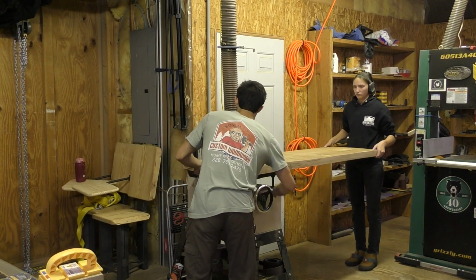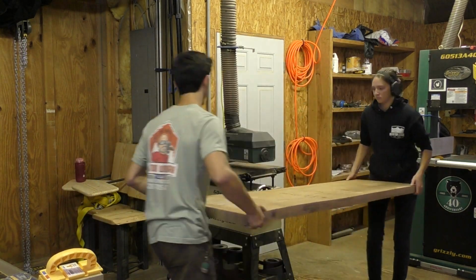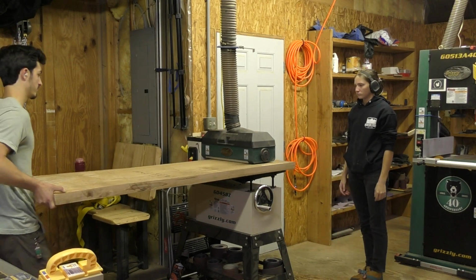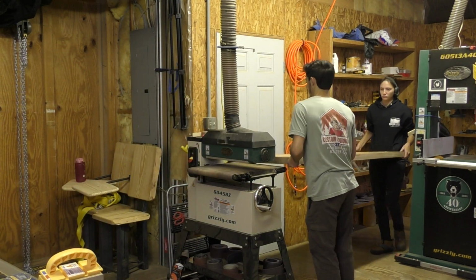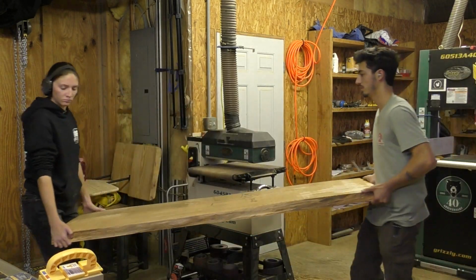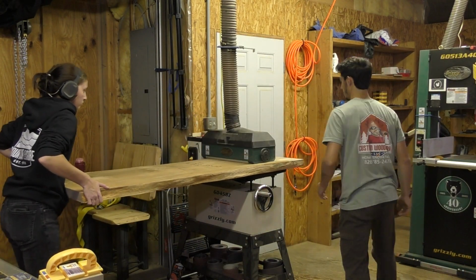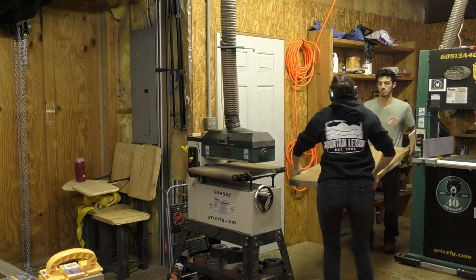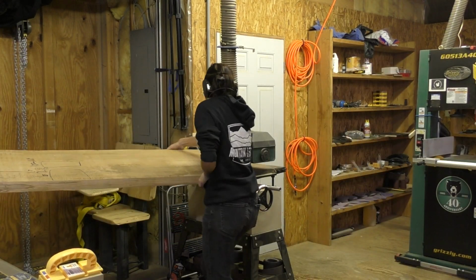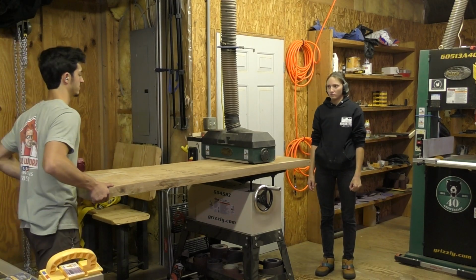And that means this drum sander was quite new to me too. I believe this is one of the first 5 times I had to use this drum sander, and I was trying to use it with 40 grit to help start to flatten out the slab. I know the drum sander won't make it perfectly flat, but if I at least get the high spots down, then it'll save me a lot of time with the hand plane.